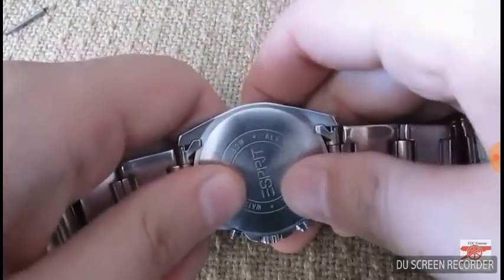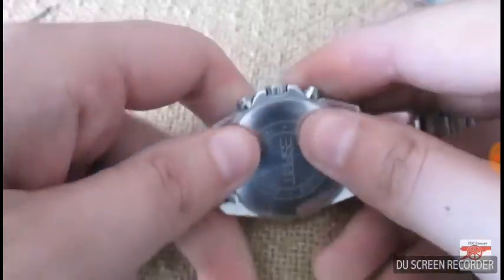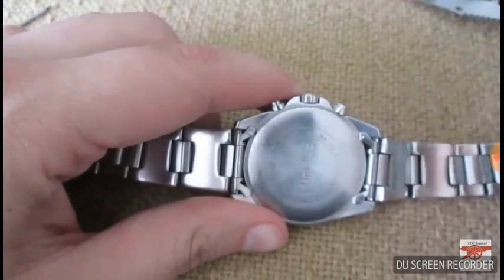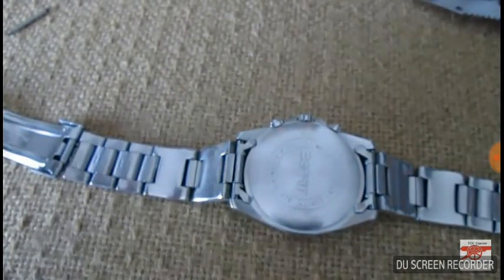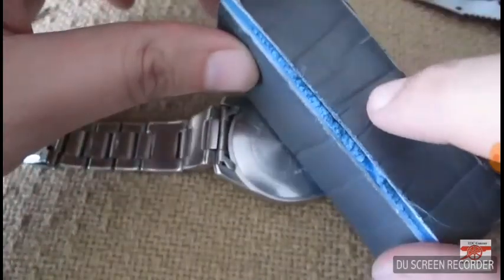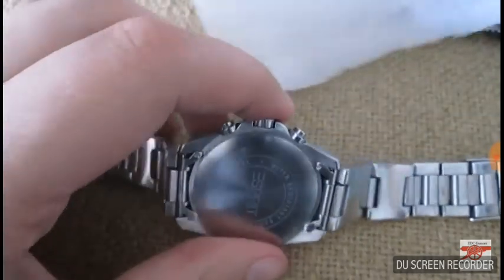I'm going to take it into my lab to pressure fit it, and these can sometimes be really stubborn to open. Like I said, that's the case for most Swiss-made watches. In that case, you might want to take a piece of wood, something hard, but wood is good, and put leverage on it. But before you do anything like that, put something soft under the watch, like a cloth or towel.